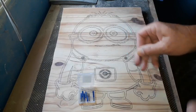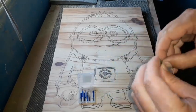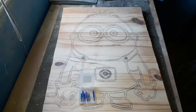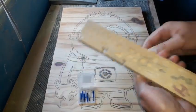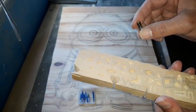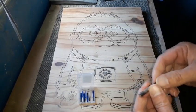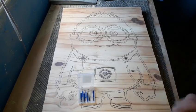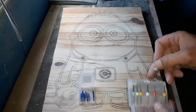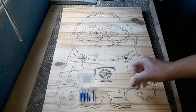So it looks like we've done a scroll saw project and stuck the wood on afterwards to a nice black backer — whereas we're basically just routing out the lines. We want nice straight sides as much as we can, so 15 degree. They have a Dremel-size shaft at 3.175 millimeters, so you do require what they call an adapter collet at 6.35 millimeters — that literally just slots in like so. That will fit a quarter-inch shafted router no problem. I always have a piece of wood with different depth markers — we don't want to go too deep on this, maybe a couple of millimeters. Once we've gone around with our CNC bits either side of the lines, we also need to remove the middle piece, so for that I use these end milling bits. They're fantastic because they clear out the side walls of the carved area plus they have a rough section at the bottom to smooth it out.